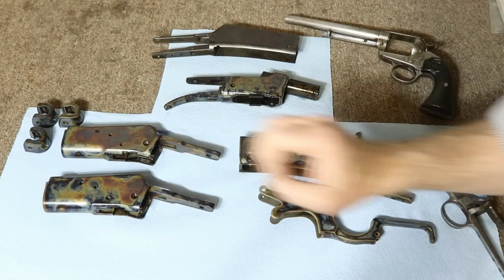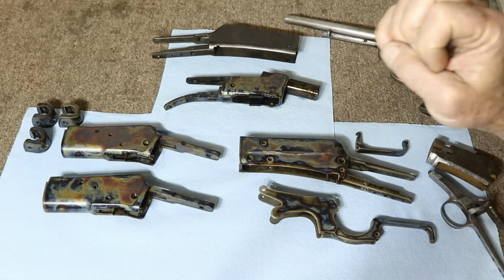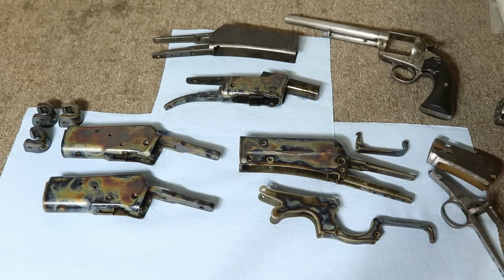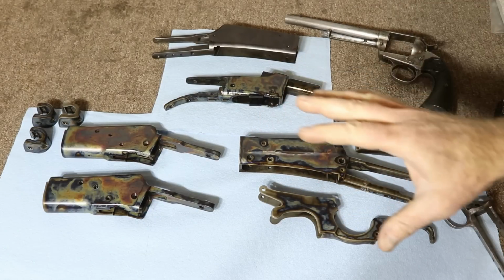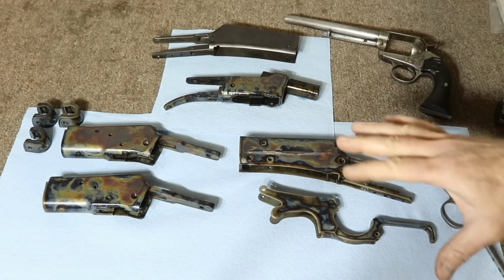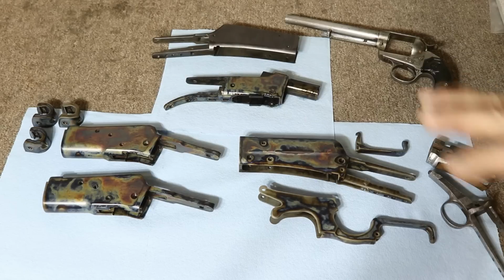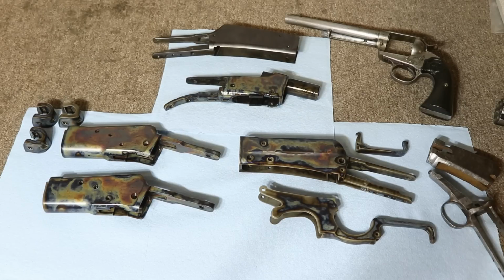And you can see these have kind of a matte finish, these modern steels, and it's thought that it brings out the color a little better on some of the modern steels. I'm not sure I'm convinced of that, but certainly it's a less expensive way to polish and finish these things, and it looks good on the modern firearms. But our previous owner would offer that on restorations for vintage firearms, and we no longer do that because the vintage firearms were polished to a much higher polish. So it just isn't correct for those older vintage firearms, and we don't do it anymore.